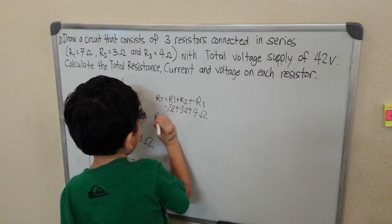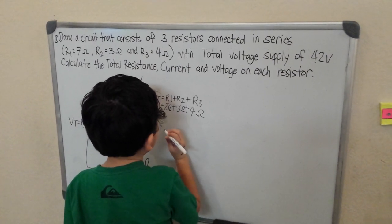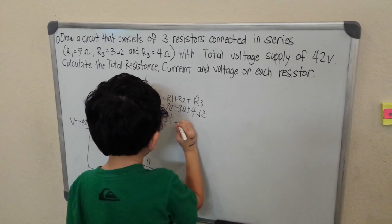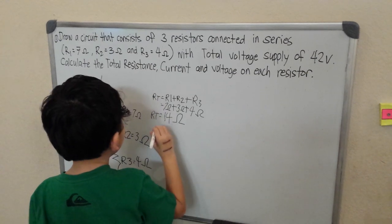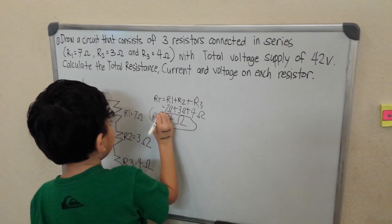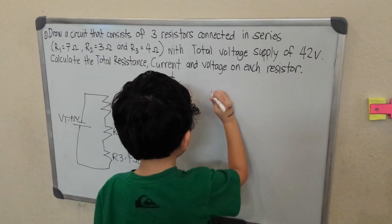Total resistance is 7 plus 3, 10, plus 4, 14 ohms. Circle that to be our answer. So